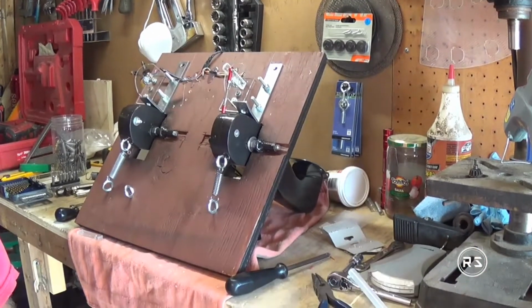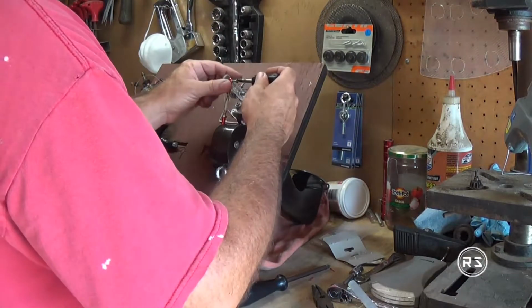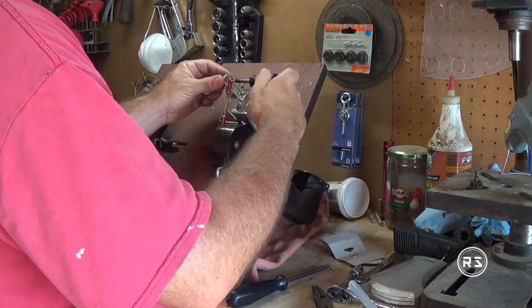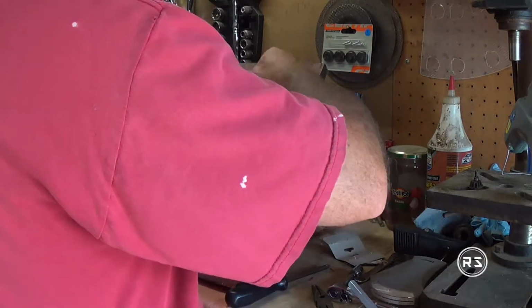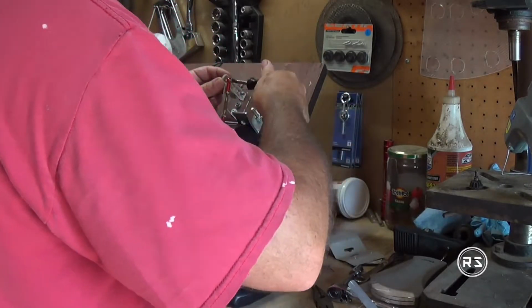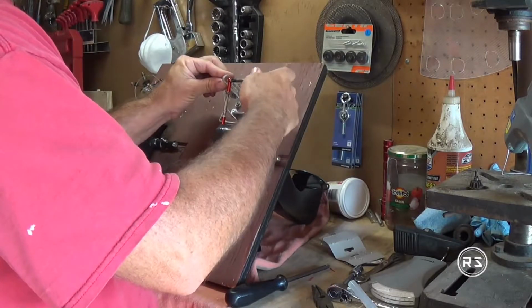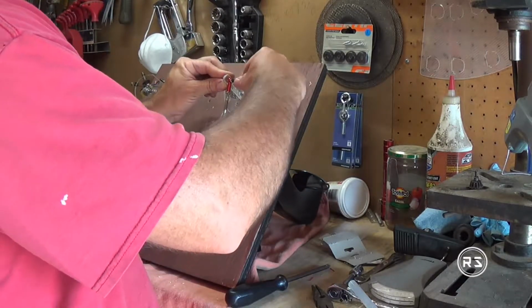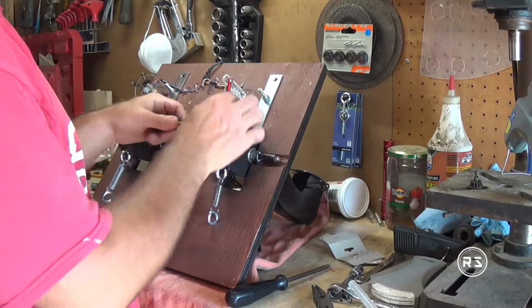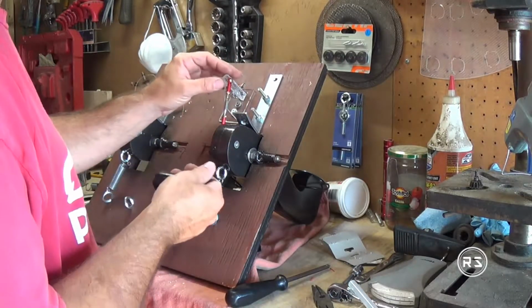There will be some more adjusting with the linkage, but not very much, since I did make the big adjustment procedure before cutting the arms, so it will be just a matter of fine-tuning. As you can see, I didn't use a bolt but a screw, and I've made the thread directly in the plastic. It will be strong enough since the potentiometer is not very hard to activate. Actually, it's very smooth to activate.